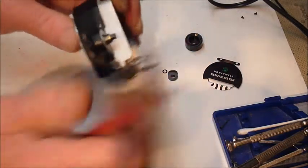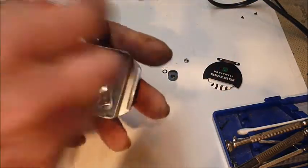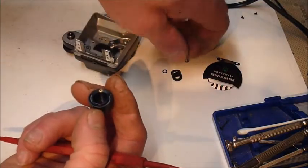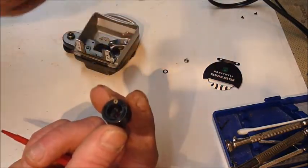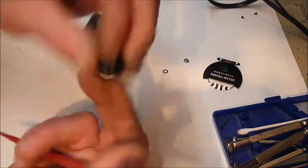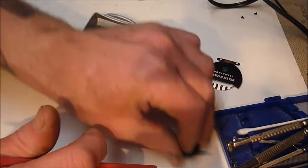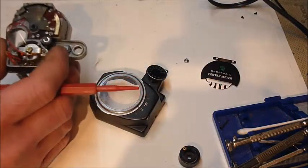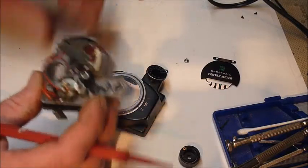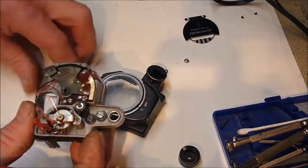You take that off, you take out that screw and that screw, and there's a screw in the bottom of this gizmo, like so. You undo that screw, this all comes apart, and be advised, there are washers inside this thing. There is a wavy washer that goes in first, and then there will be a combination of other shim washers that go with that. This also is a flat-sided hole, so it only goes on either the right way or 180 degrees off. That will be important later on. So you get that open, you take the top off, and you're going to see this. Actually, you'll see this first. Two screws, take that off, and then you will see the rest of this.